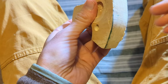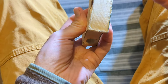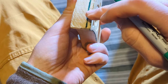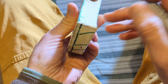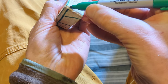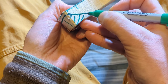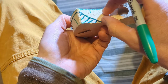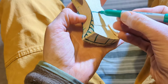So the first thing I like to do is mark what would be the cutting edge on a real axe — about half a centimeter. We're going to leave that, and all of this we will be carving away. Then from our line here we're going to taper it like this. This is the top edge, so we're going to remove all of that — this will give the appearance of a real axe, with the cutting edge getting fatter here and tapering down.